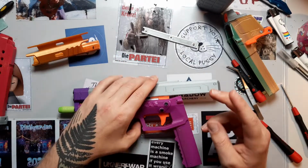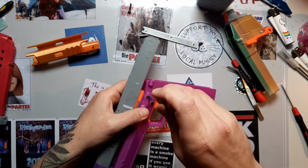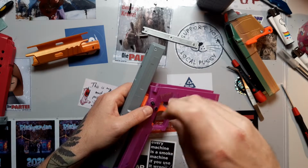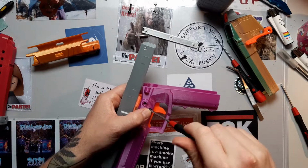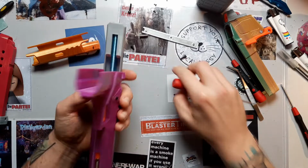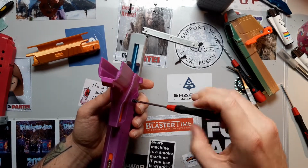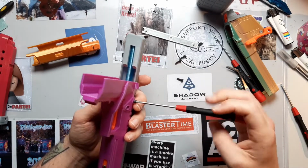Then there are the 4 screws in the turnaround, 2 on this side, 2 on this side. Let's get those out. If you've purchased your Gecko as a complete build from me, these might be a little tough to get out. It's because they have a thread lock on them to make sure that they don't go anywhere on their own. But yeah, they are in heat inserts, so it's all fine and good. Make sure to open that completely. There we go.